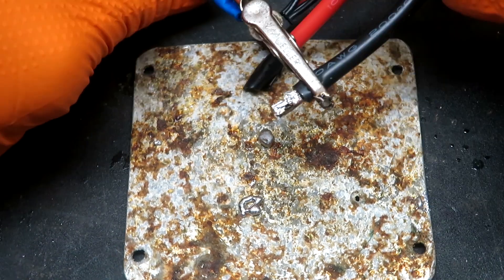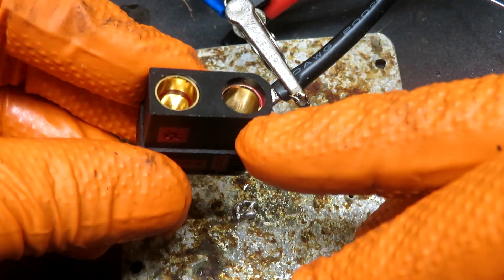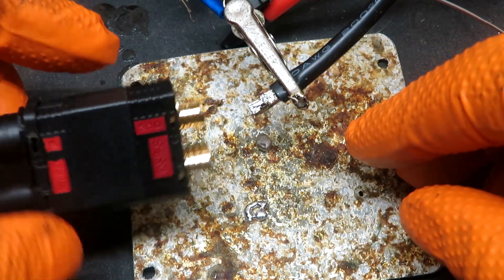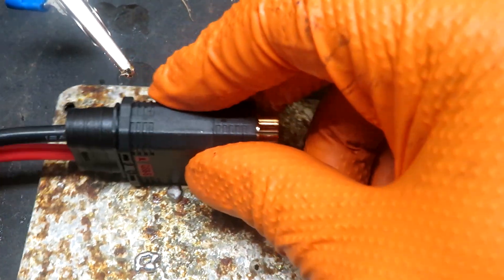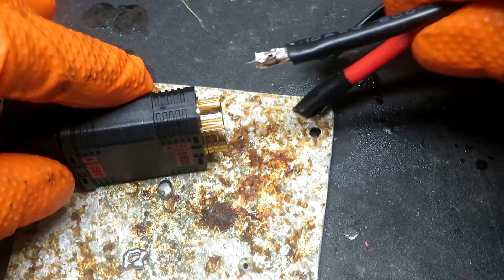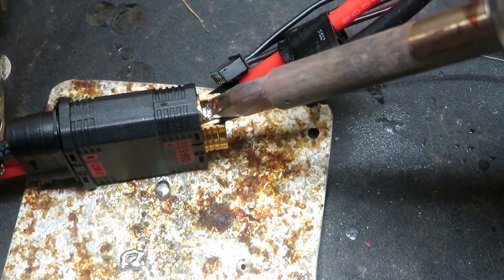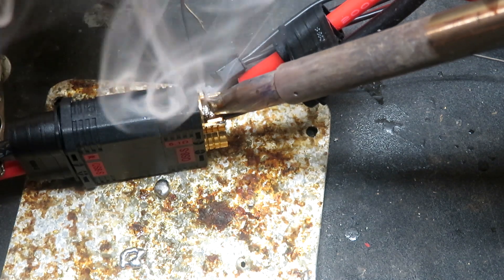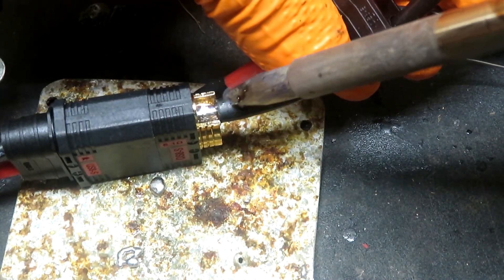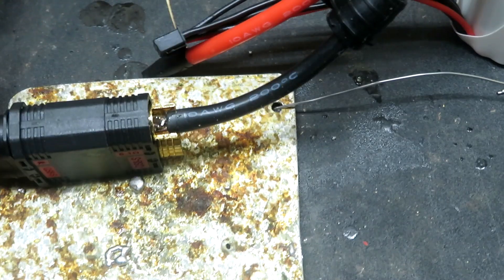All right, so now we've got that part done. Now we can go to the connector. Here's our connector — it's a male connector with female pins. Here's a dummy female connector. You don't want to misalign the holes. We're going to want to try to keep the connector stable. We already have the wire tinned. I like to add a little bit of flux in here. Carefully get our wire inside and we're going to try to get it all done. So we've got some more tin on the wire, now I'm going to get some more tin up in there.